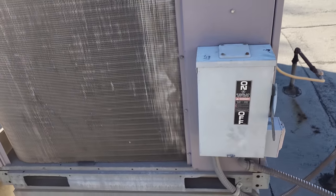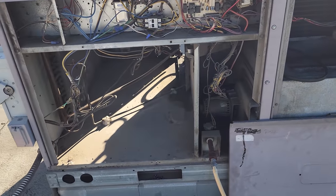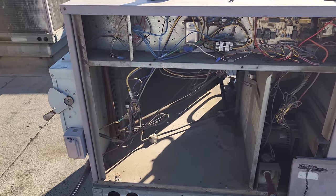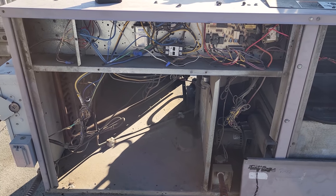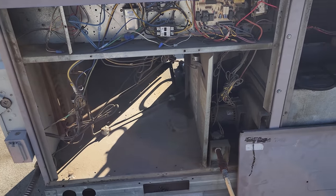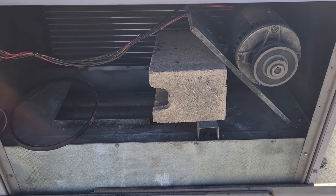So big picture stuff here. Don't just stop at the refrigerant leak. Start looking, why is there a crack in the line? What caused the crack? We bumped the compressor. Now it's not ideal to run a compressor with no gas in it, but we just gave it a bump to make sure it wasn't shaking to all heck or anything. No, it sounds clean, sounds fine. Yeah, everything is looking like this is a repairable unit.